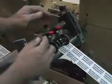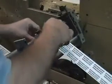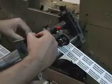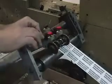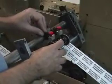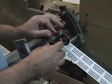Okay. Now, this device here just clamps to this bar, okay? Unlike this one here, which is keyed into a groove back here, this is not keyed. So the way it's secured to this shaft is just by clamping down here, and it just wedges it and holds it in place. That's fine. That's going to be part of our adjustment. We're going to adjust this thing this way by having this loose to make our coarse adjustment, and then our fine adjustment is done with this, okay?